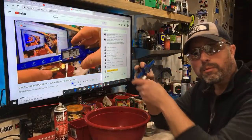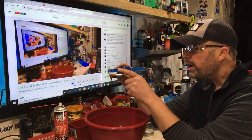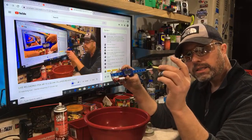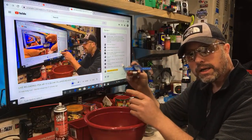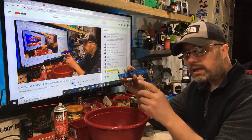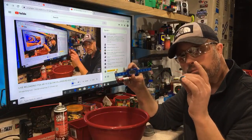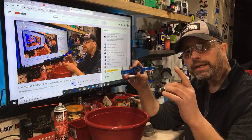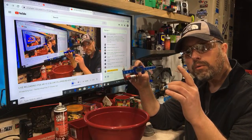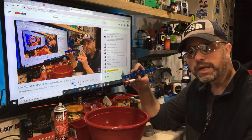In that box that I'm about to ship you, a brand new set of calipers that are just like this, same brand, same headspace bump gauges, and I put that exact same piece of brass in that box, and I shipped it to you, and you checked it out, it's not going to be the same. It's definitely going to be a little off. It'll be really, really, really close. It might read, instead of 1.453, it might actually read 1.454, or maybe 1.456, like in your example.